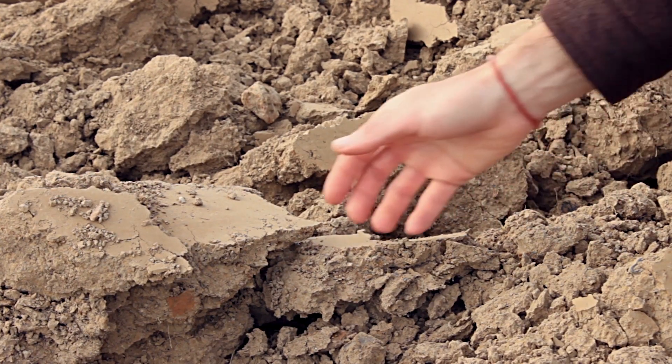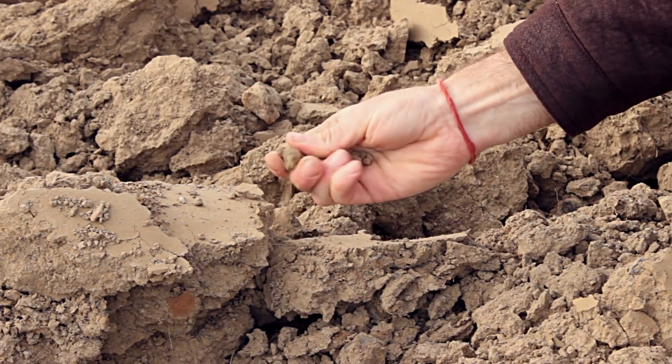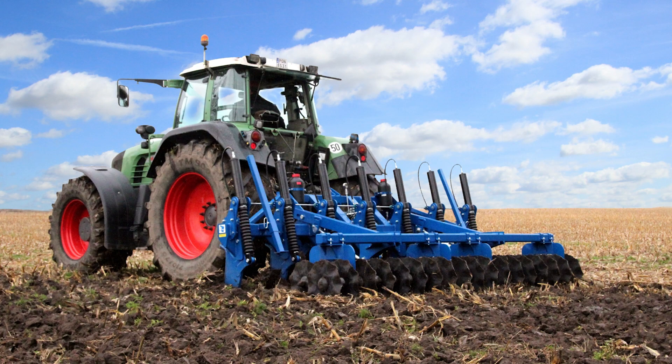This procedure is best performed after the harvest when the soil is dry. It is usually recommended that subsoiling be performed every 3 to 4 years. Generally, it is worth loosening the soil 10 to 15 centimeters below the deepest cultivation depth.